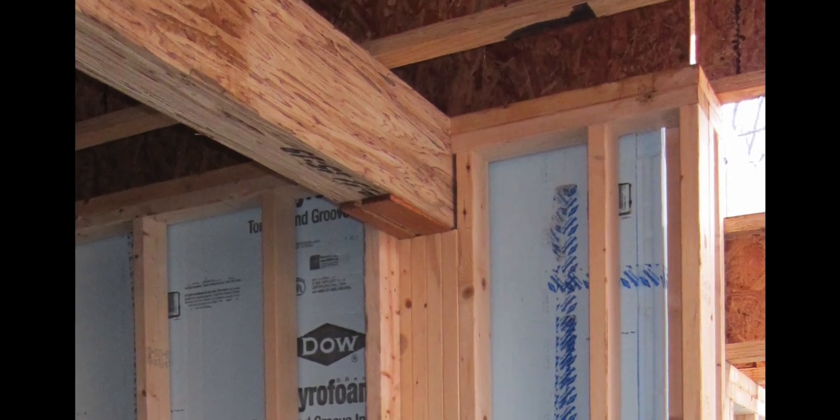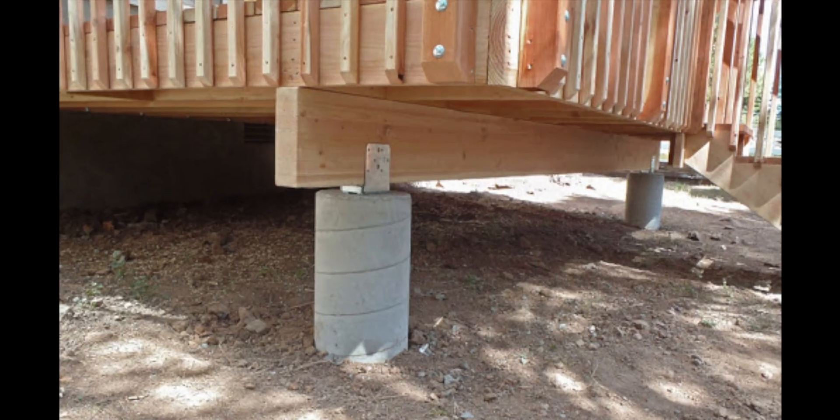Make sure there are at least three or even four two-by-four jack studs under the beam if the beam is up to 18 feet long — possibly more depending on the load. In some cases you may need to add a new post altogether and a footing or drilled caisson to provide support for your beam. This is often done in basements where a steel post supports a steel beam or heavy wood beam carrying the floor above. If you need to add a steel post, I would recommend calling an engineer.